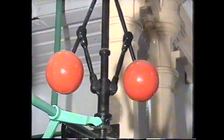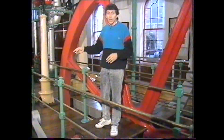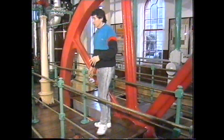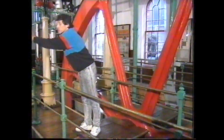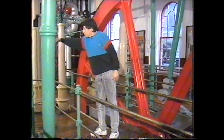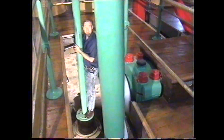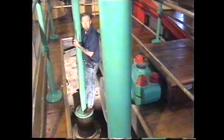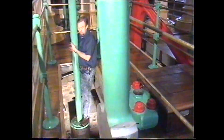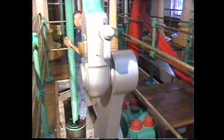Right now it's running at a speed of one and a half revolutions per minute. It could run up to 12 revs per minute, but normally it operated at about four or five revolutions per minute. Besides this particular shaft, there is another very important shaft going down there — it's the rod that I'm clutching, and it's driving what I'm standing on: an absolutely massive piston. This is really the point of the whole exercise. The steam engine drove this piston, which is part of a huge pump that for 50 years supplied water to the city of Auckland.